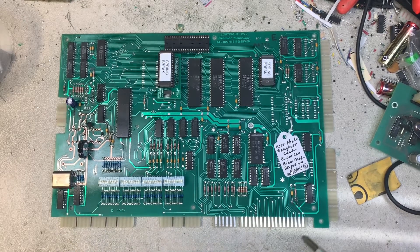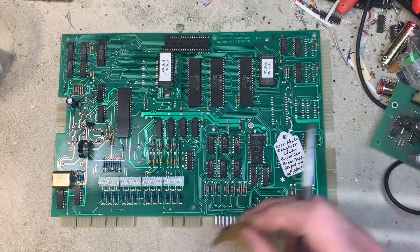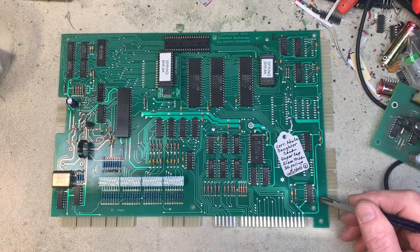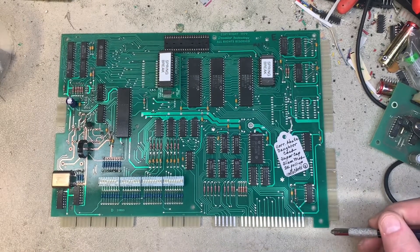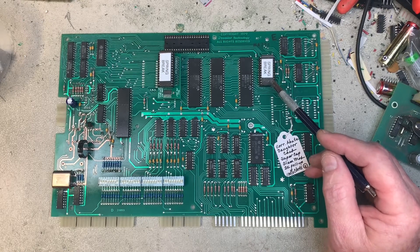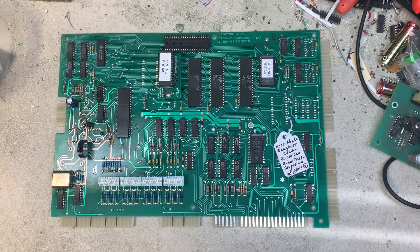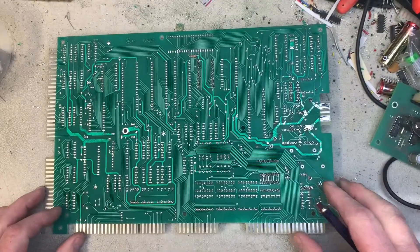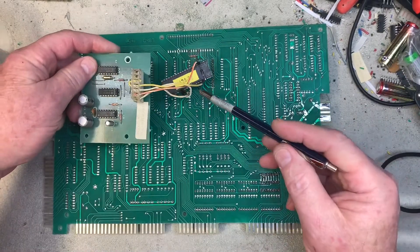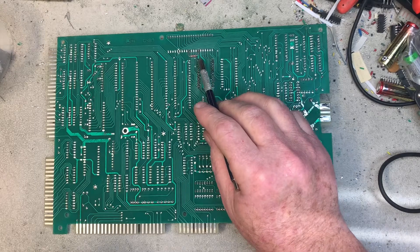I've installed a super cap — this is a 1.5 farad, 5.5 volt cap — and reinstalled the crystal along with these 2K and 5.6K resistors. Down here we have the slam switch mod, which defeats the slam switch at the door. There's another mod in the Pinball Wiki involving scratching off solder mask and adding a solder glob, but I like this method better. I've covered the ROM windows with a nice label from my Dymo label maker. This is the nvram.weebly.com daughter card. On the back of the board, replacing the old reset card part, is a 3K pull-up resistor for the read/write line soldered across pins 7 and 11.